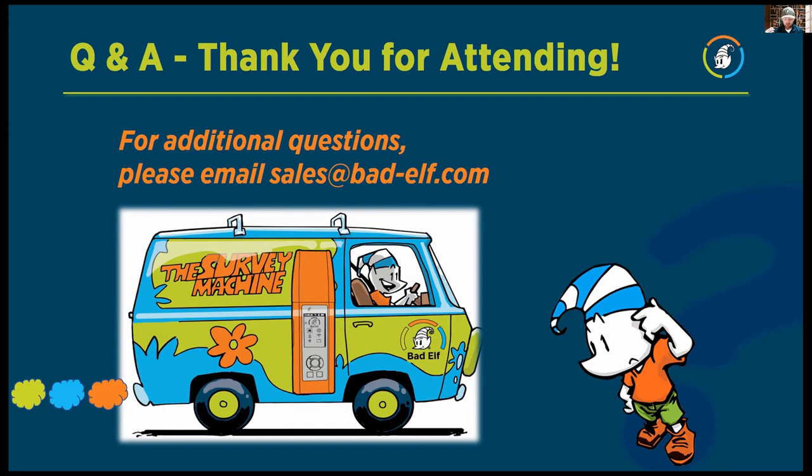What we are part of, of course, in the United States at least, about 50% of the states have free RTK networks that you can tap into. You just need to find the right person to talk to. The other half of the states have for-pay options. I believe California, Caltrans, for example, is about $500. I believe it's a one-time or once-a-year fee, I can't totally remember. For example, in Texas, where I live, you can get on the TxDOT RTK network for free as long as you're doing TxDOT work. So first option is always try to find that free version, quite frankly.